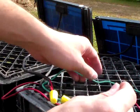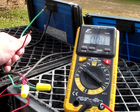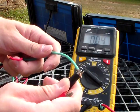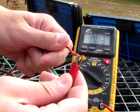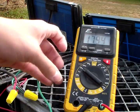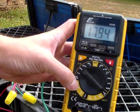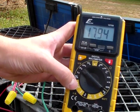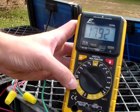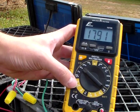Let's go and check the volts and amps on it. My multimeter is set up for volts, so we'll test the volts first. Clip my meter to my negative lead, positive to positive. And you see the volts is the same — 17.9. So let's switch over to amps. The amps should actually be increased. I would say 0.20 in this type of light I have here. I wish it was sunny right now, but it should be about 0.20 or 0.30.